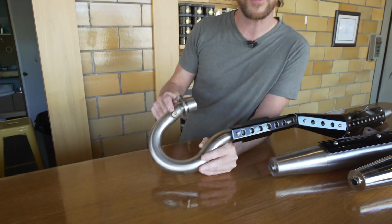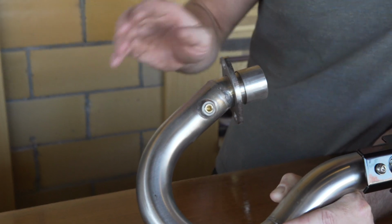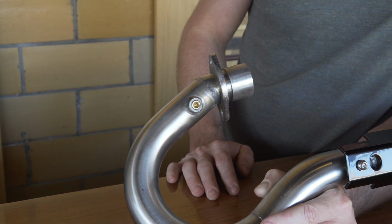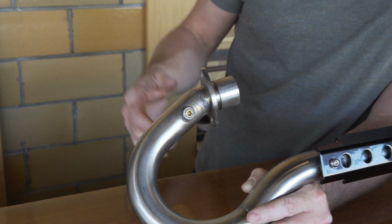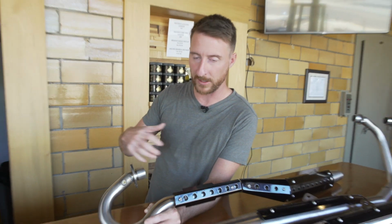This is for our 5-gas analyzing machine. So before every bike leaves the factory, we actually hook up an instrument here that will measure the 5-gas mixtures coming out of the exhaust, and that way we can ensure that every bike that leaves our factory has the proper tune on it.